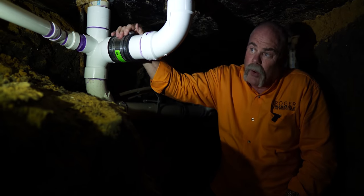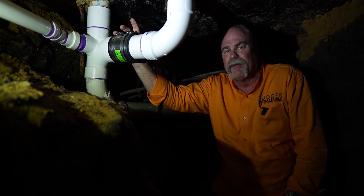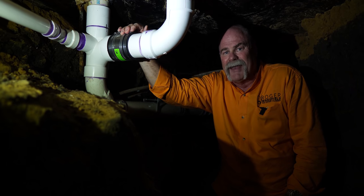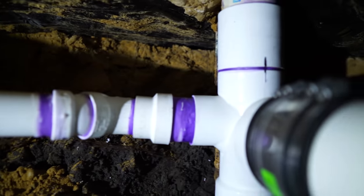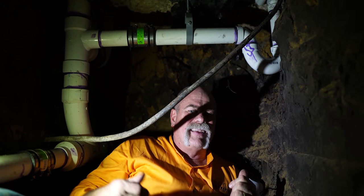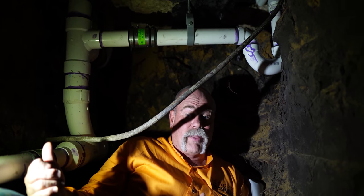The shear band with the metal band around it makes sure this will never shift or offset. We've seen a lot of plumbing companies just use a regular Fernco gasket underground — we don't want to do that. We want whatever we put in to be solid, not move, and have no problems at all. That's the reason for the hangers, the shear bands, and everything done the way we do it. Now we're in the other hole on the other side — this one is only about 12 feet deep, while the other tunnel was about 20 feet deep.